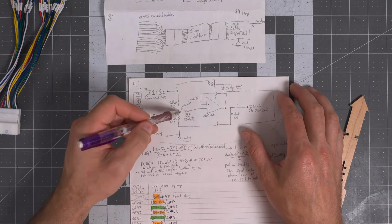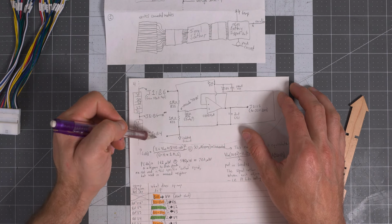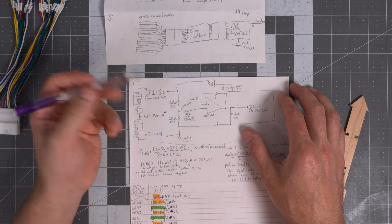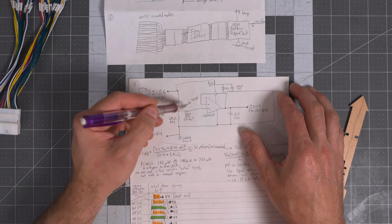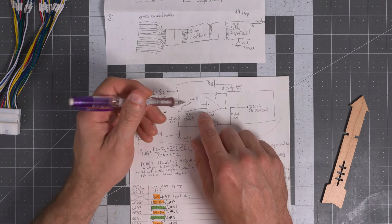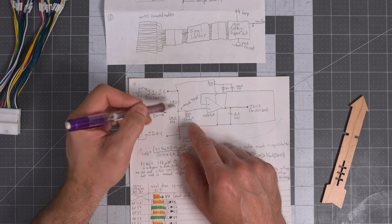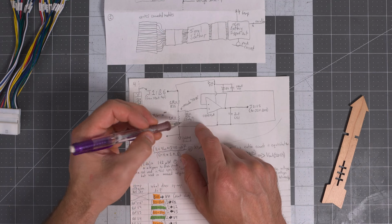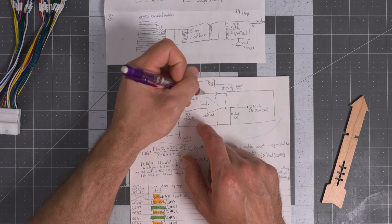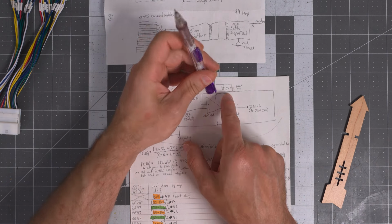Why? If you have a mega ohm of resistance here, this is your B6 minus B4. Anyway, that seemed unnecessary. Maybe that was just stuffed because maybe that needed to be disconnected. There was no alternative circuit here. This component is completely unnecessary. Honestly, if you're going to waste the board space on this, you should put it here instead. It's not there. You should put a 1 mega ohm there so that the input impedance is the same on both of those.